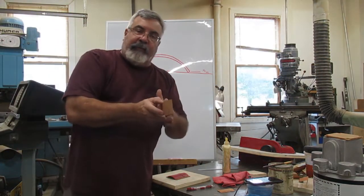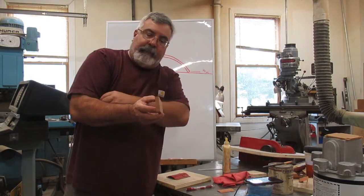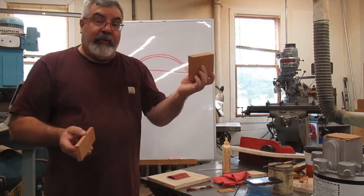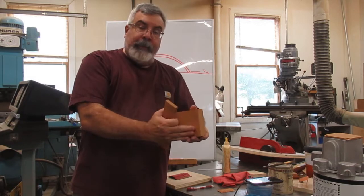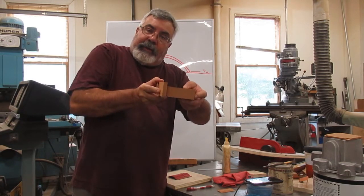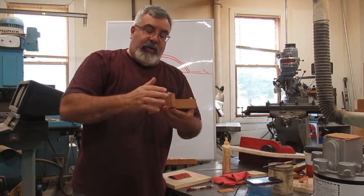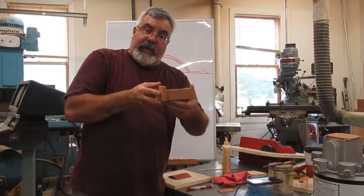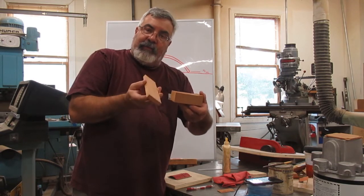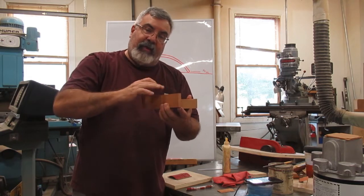For me to flip this up and hold it square up against the blade is kind of near impossible. So I just took a piece of scrap wood. I got 90 degree, right? So I'm going to put that up against there on the bandsaw, okay? For sake of just doing it, I'm just going to go over there and do it. But that's how I do that. That'll keep this straight, okay? And then I'm keeping this pretty long. I'm going to cut everything else out.